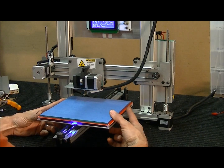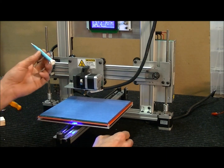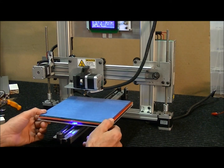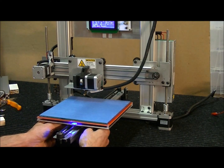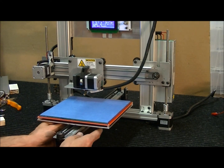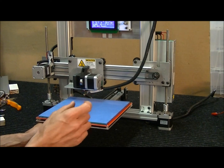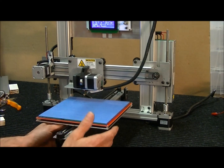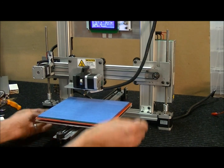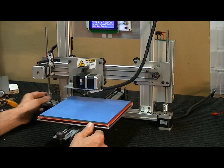Normally you just have to adjust this little screw right here with the blue ceramic screwdriver. First, you want to make sure that the bed is not moving around wobbly. These V-wheels underneath have a nylon spacer on one side and an eccentric spacer on the other, which is offset — as you turn it, it brings the wheel closer to or further away from the rail. You want to be able to turn it with a little bit of resistance — that's about the right tension.